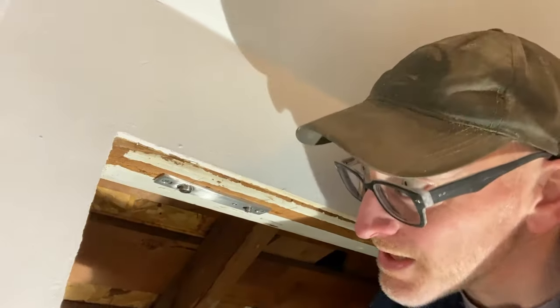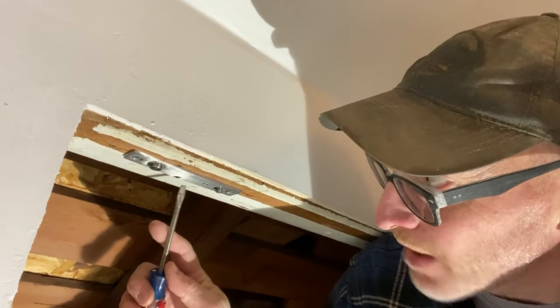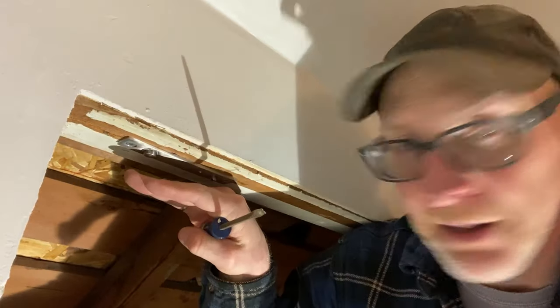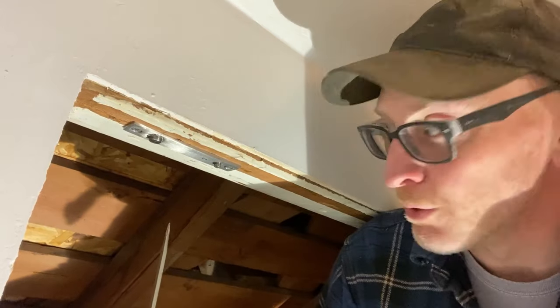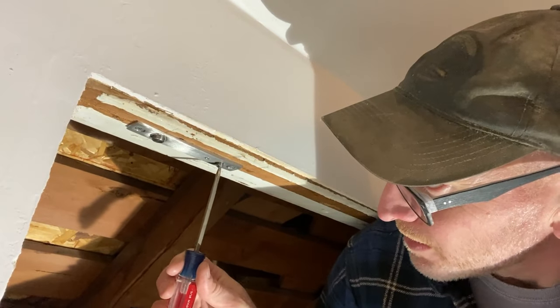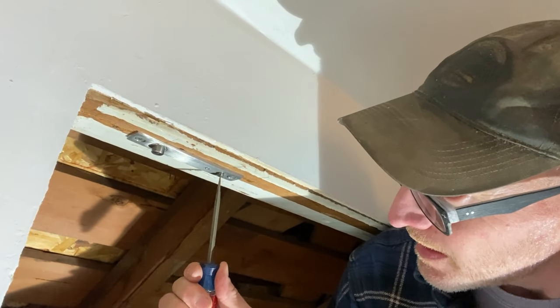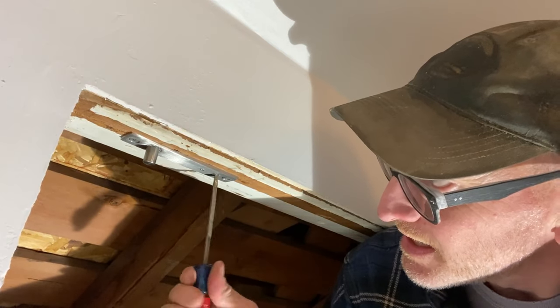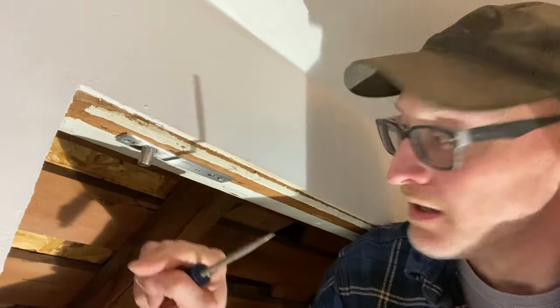All right, guys, I'll show you one more time how this upper hinge works, because this is really where all the magic is. We've got a set screw here. We've got the hinge pin itself. This is retracted, so you see that it's sticking out about 1/4 inch on both sides. This allows us to fit the bookcase into the opening. Once it is, I'll stick the screwdriver up through that top shelf, through the hole we drilled, and then we'll turn this guy clockwise. And as you see, the pin comes down, locking the bookcase into place. And that's how it's going to be hinged, right there.